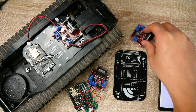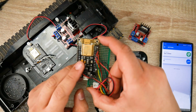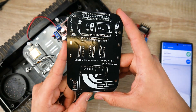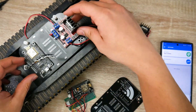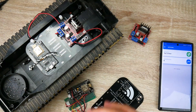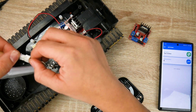Let's talk about the components. We're using an L298N — a three-dollar brushed motor driver. We also need an ESP8266; I'll have those linked below — the V1 is preferred but V2 is also fine. I also have a custom-designed PCB, which is optional, but it makes life much easier. Most of the pins are broken out so you just plug in and you're good to go. We'll take a closer look at the PCB later.